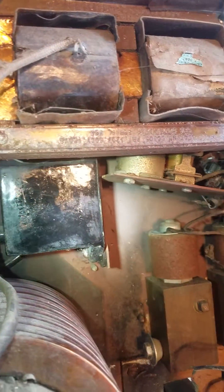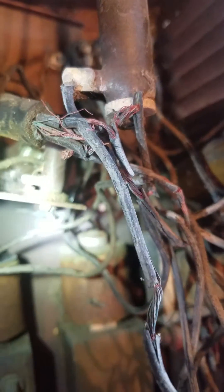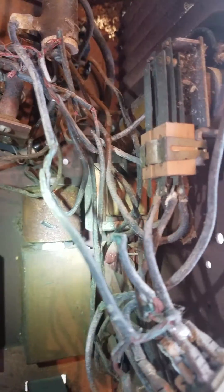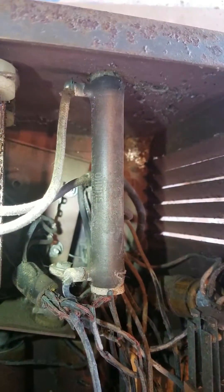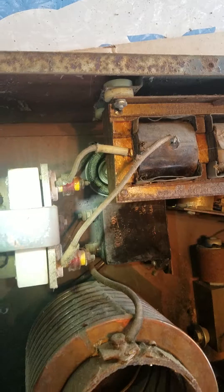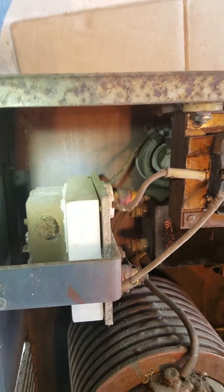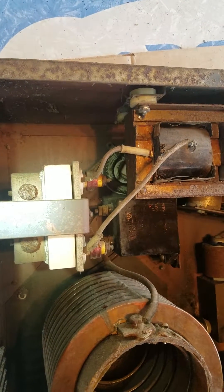The spark gap down in there generates a ton of ozone, and that ozone tends to eat up wires. Let's see if we can get in a little closer on some of these wires — the insulation is just gone, just from age, more than a few decades of welding and use. I did contact Lincoln, and they were more than happy to send me a parts listing and a wiring diagram for this particular model.